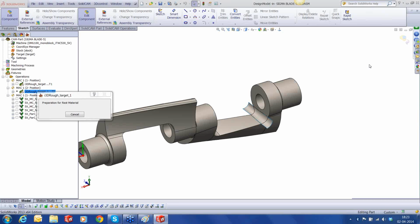Of course, the holding in this case on a monoblock is not just by one chuck, but it is by two power chucks on either side. So that is one of the criteria for holding. It's not going to be held on one side by a power chuck and the other side by a tailstock or something, but it's between two power chucks.